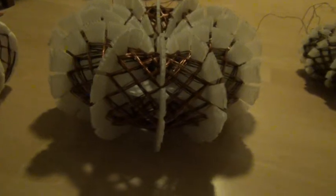But I could actually use some help from you guys. Because when I connect this coil to the oscillator that I have made at the moment, which to some degree works on 100 kHz — which I set this coil to function on — you get very much noise, because the coil itself interacts with the oscillator. Even if I use a simple amplifying circuit that I have made, it's very simple but it still affects things, so the signal to the coil gets very messy, and the efficiency goes way down to the extent that it doesn't really work.